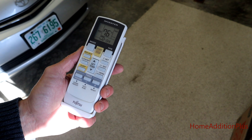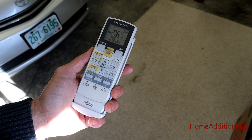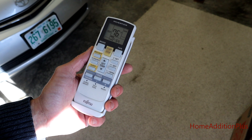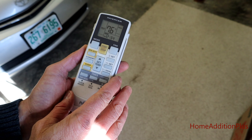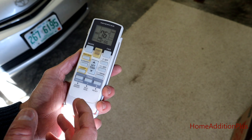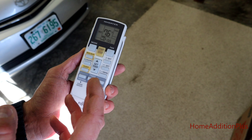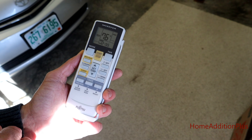What will happen is the compressor and condenser on the outside will take a couple minutes to warm up and get going at a very slow level. But within two, three, four minutes, the evaporator unit will turn on and we'll start getting the blower actually blowing out heat. A couple other features of this remote controller: you can set it on a timer, a seven-day timer, and you can set it for different temperatures throughout the day. Virtually anything you can think of from a typical digital thermostat control, you have all that capability in this handheld unit.